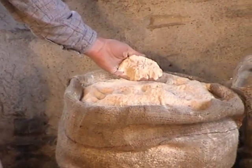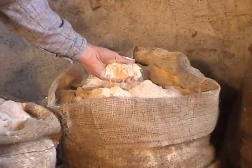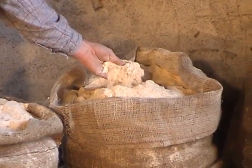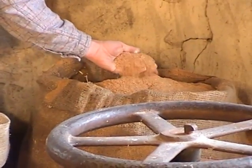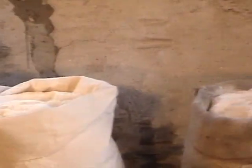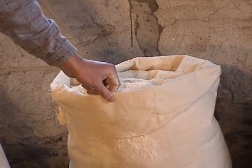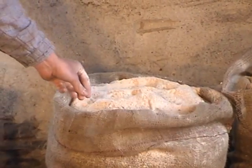Third was a low-grade flour, later called middlings. This was used mainly for livestock feed. Shorts was the softer part of the kernel of wheat and was used in livestock feed. What was left was the outer brown husk called bran. It was also mixed into livestock feed. Flour was bagged into cotton sacks and livestock feed was put into burlap bags, which would then be sewn shut by hand.